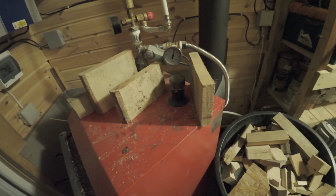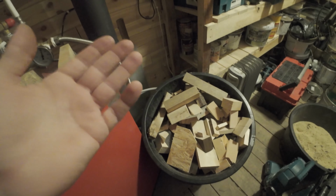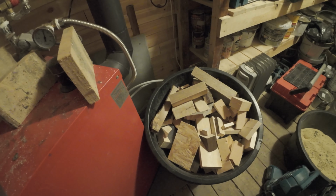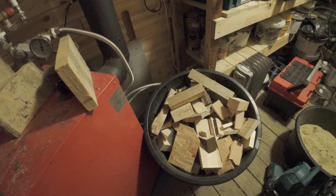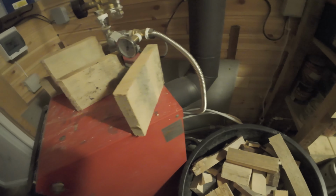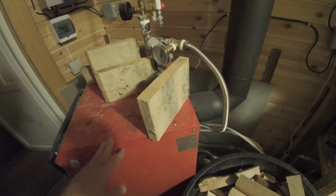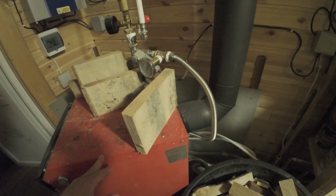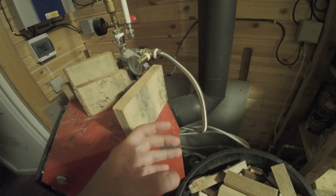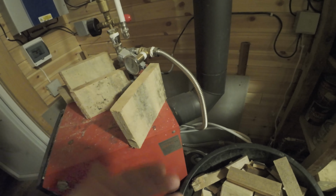thus causing less airflow in the chimney. But in a way it could be more economical, but then you need much drier wood, really highly dried wood. So, speaking about the setup, how do you set it up? I believe the stove has to be as close as possible to the tank, with the fattest, largest-diameter pipes, and you can put a normal heat pump there just to circulate the water.